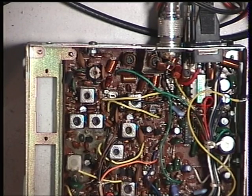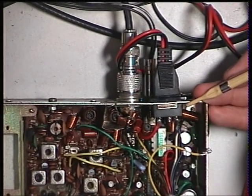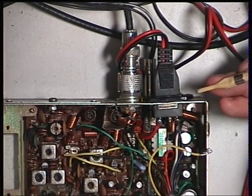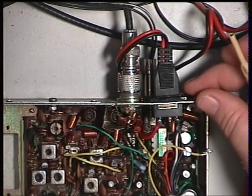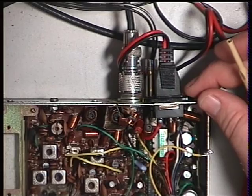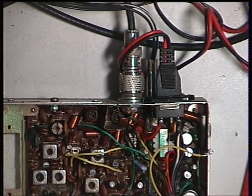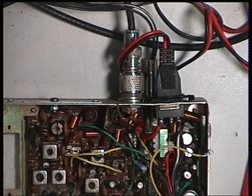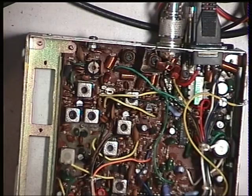In the meantime, I'll be screwing in — we all know this is the wrong kind of connector, the UHF-type connector, but that's how it's going to have to be. I'll be drilling into the chassis and tapping for the same screws we use in the sides of radios. I'll be fitting a meter lamp and rewiring the filter switch, which has lost its capacitor. There we go — that's the Midland 3001 from 1981.